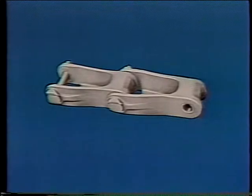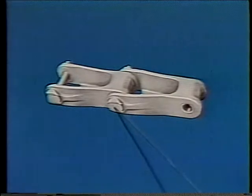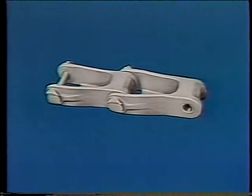Progressively heavier chain is the class 800 steel bush chain. This particular chain has a bushing put into the hole, and this bushing is replaceable along with the pin. This makes for longer life because the pin and bushing are the points which normally wear out first. Since these can be replaced, you get extended life out of the chain. These bushings are normally hardened steel or manganese steel. Manganese steel is a special steel with work hardening properties — although it is not hard to begin with, with service it will get hard. This hardening only takes place on the outer surface, and just underneath, the material is tough stringy steel, making manganese steel an ideal shock and abrasion resistant material.